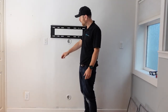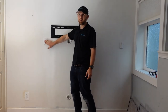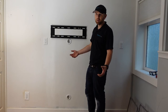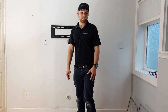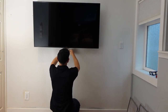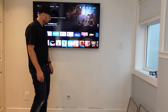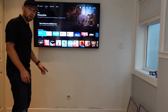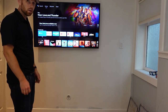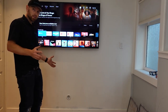It works! The top outlet is good — these two lights mean it's working properly — and the bottom one is good as well. So there we have it: we now have an outlet behind the TV. This was the bridge kit method before, and now we have the cleaner method because there's no cable going from the wall down to an outlet. This one is more difficult, of course. The final step is to put the TV back on, plug it in, and it works — no cables going from down below to the outlet, no dangling cables, nothing. It's a very clean look, but it does take a little electrical know-how and the right tools.